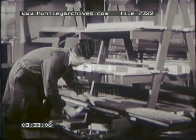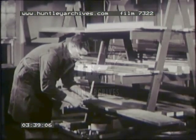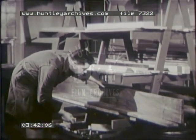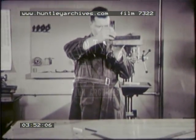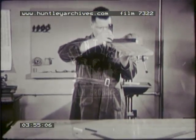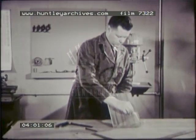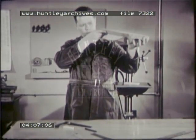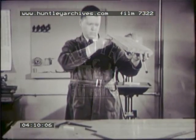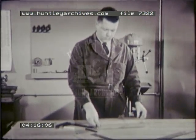Select stock for your project carefully. It should have a minimum of imperfections. Before using a piece of stock for a project, it must be squared to ensure good appearance and close fit. First, cut the stock to approximate length. Check with a straight edge to see if the stock is warped. If there are high spots, mark them and plane them off first. Your stock may have a lengthwise twist called wind. Check this by sighting along the stock or by putting it on a flat surface. If it has wind, it will rock on opposite corners. Mark any high corners.